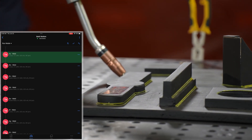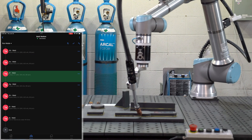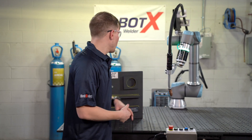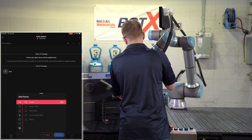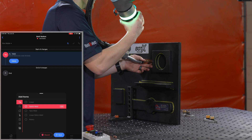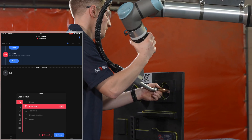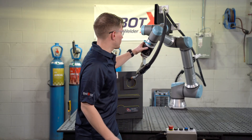Here's that air motion that we taught, and now we're back into our linear weld paths. What we're going to be doing next is teaching the BotX on a vertical plane. In the software we're going to select a radius weld, just as we would if the part was flat on the table — we're back into teach mode here. On this vertical plane we're just going to trace out the outside edge. Here's position one, here's position two, three, four. To complete the circle we're going to go back to our initial position as well. Teaching a radius on a flat plane uses the same method as teaching on a vertical plane.